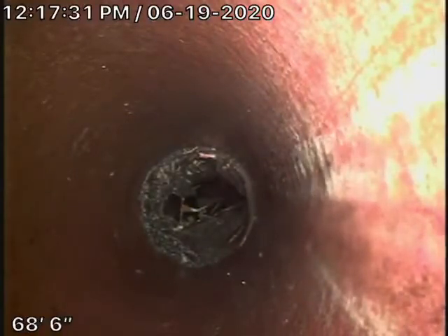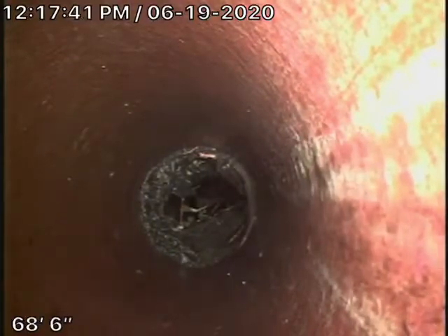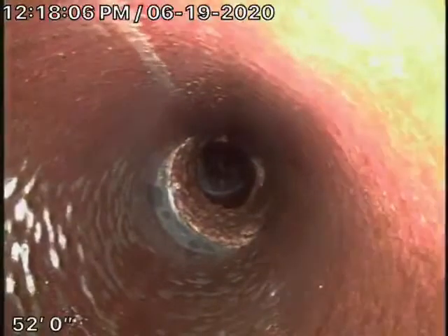We're going to run our camera from the main house and try a roof access to check the piping under the house. Obviously we cannot check all the piping throughout the house — that's why you'll have your general inspector run all the water and stuff. But right over here we do have some roots; they are maintainable. Or you're going to make a repair over there, because the rest of the pipe all looks pretty good. It comes back with a section of clay piping here on the property. Right over there is where the front house two bathrooms on the left-hand side tie in, and that's outside of the house. You're going to keep coming back through a clay pipe, which actually looks like it's in pretty good condition.